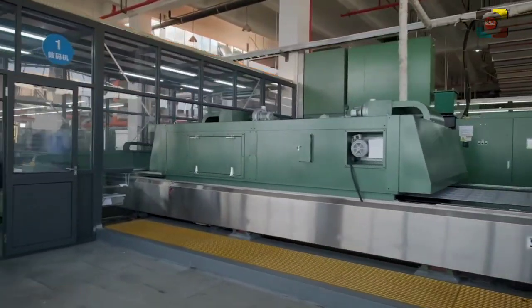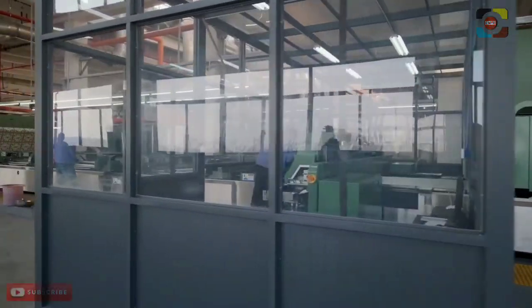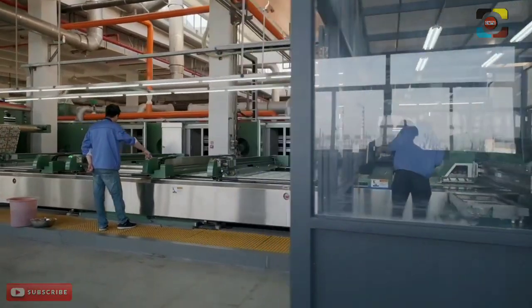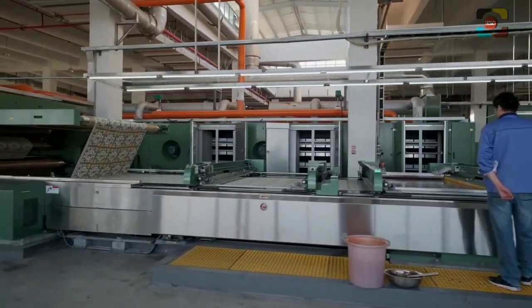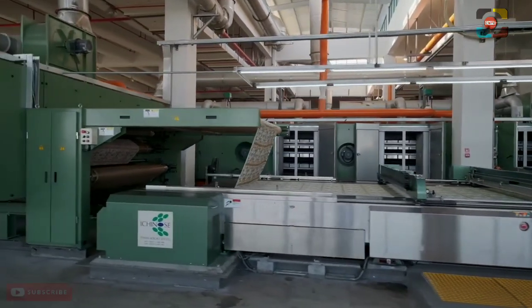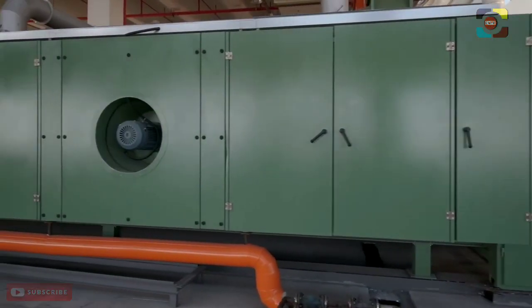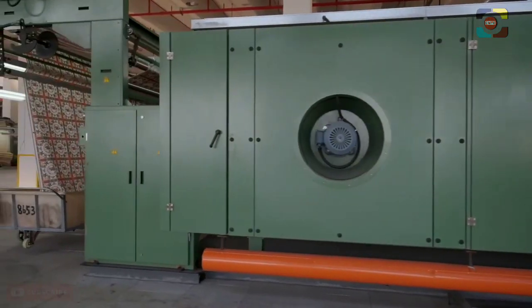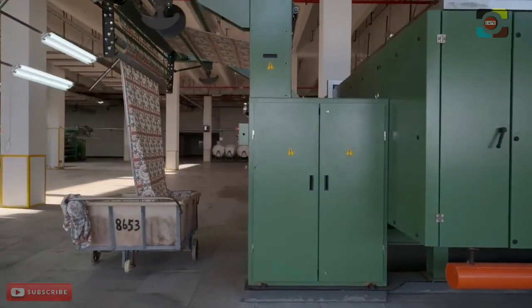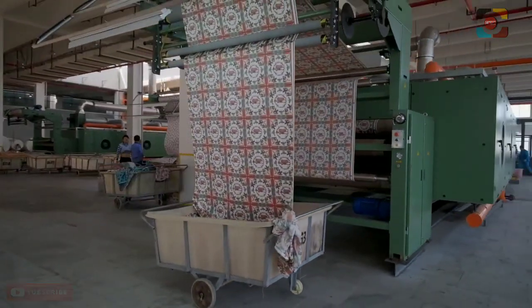The Yugo Hybrid Printing System is a combination between the conventional flat screen printing system and the most advanced digital printing system. The main purpose of this combination is that designs with a large number of colors can be printed using the digital printing unit, as it is impossible using flat screen printing only, whereas the ground part of the design will be printed using the flat screen printing units, as the digital printing system has a lot of problems with uniformity.